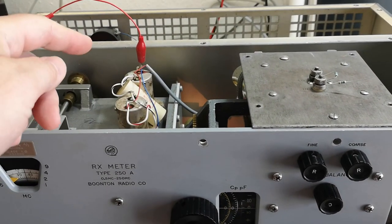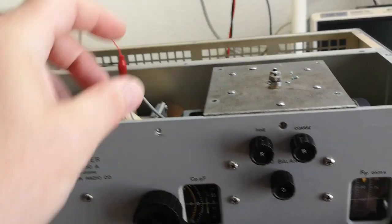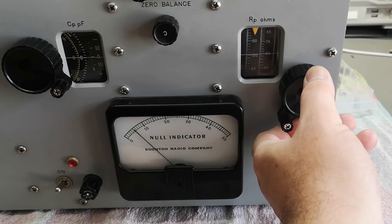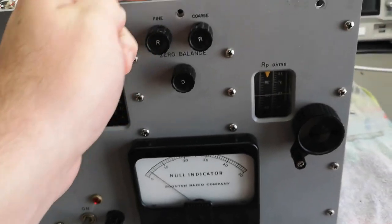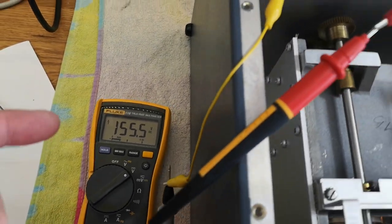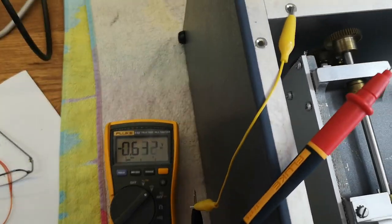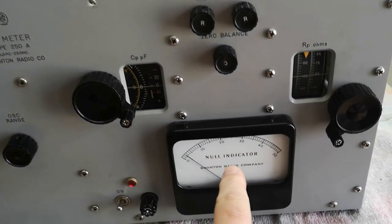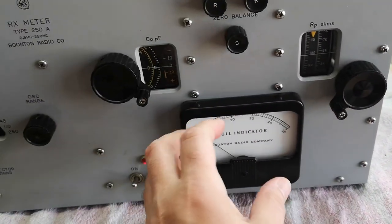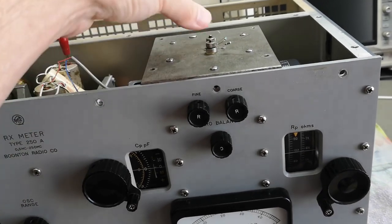Playing with the injection oscillator pot meter: at full crank-up of the oscillator we get a super good reaction on the 100 ohm resistor being measured, reading 155 — a little too low. When we crank the voltage down to zero there's no injection, so no mixing signal, but there's still signal going to the resistor, so now you effectively have a signal generator.